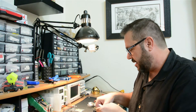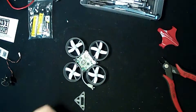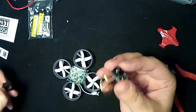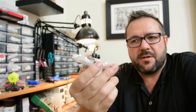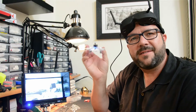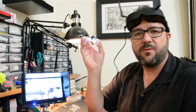We'll mount the camera and solder the power wires to the main board where the battery connects to the flight controller. That should be pretty straightforward. Alright, that's it — tinywhoop.com made it easy with all their parts. They had the motors in stock, and their little camera mount gives a nice 10-degree tilt. We're ready to put a battery in, power it up, and test it out. We're powered up, the camera is lit, and the lights are blinking because it's ready to pair with the controller. You can see the display is showing the view from the drone — we'll be whipping it around the house tonight.